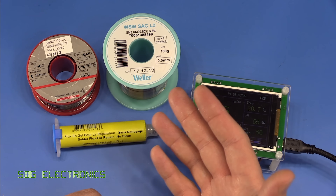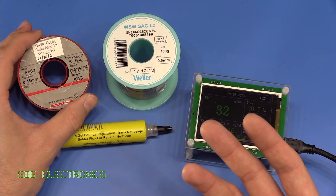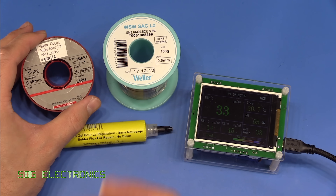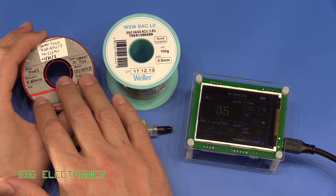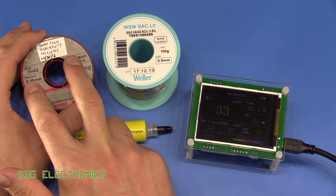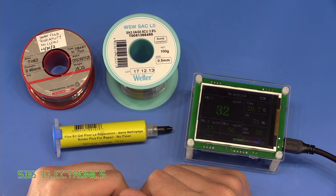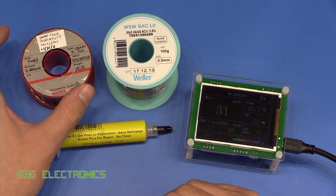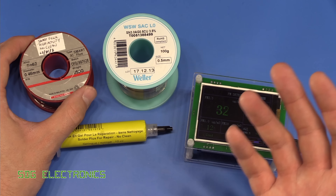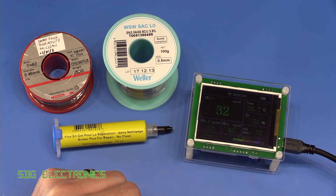Just a little bit of background about what we're actually extracting. There's often the myth that lead solders are really bad for you because when you're soldering, you're breathing in all the fumes. Actually, there's nothing to do with the lead when you're soldering that is harmful in terms of breathing stuff in. You never actually get to the point where you're vaporising the lead - you're only melting it and creating your solder joint. What you're actually burning is the flux. Almost every flux product is harmful to the respiratory system. Rosin-based solders are particularly called out in the health and safety guidance from the HSE in the UK as one of the most particular types of irritants to the respiratory system.